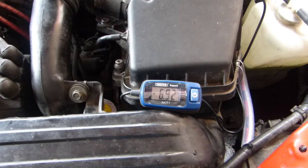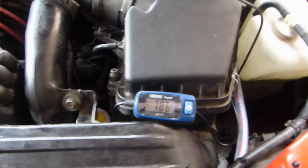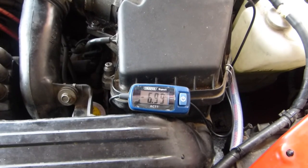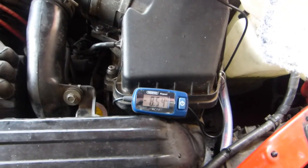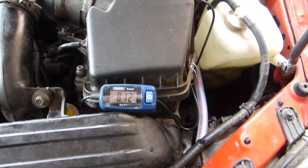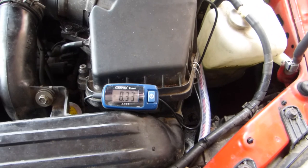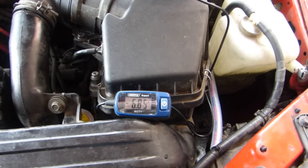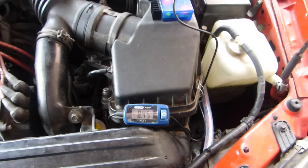It's just over eight and a half amps and it's pulsing. You'll see that's going up to nearly nine there, and then it goes down to six. I'll give that a little tweak. That's better — it's coming on at just about eight and a half and it should go down to about six and a half. There she goes. So that's the current it's drawing.